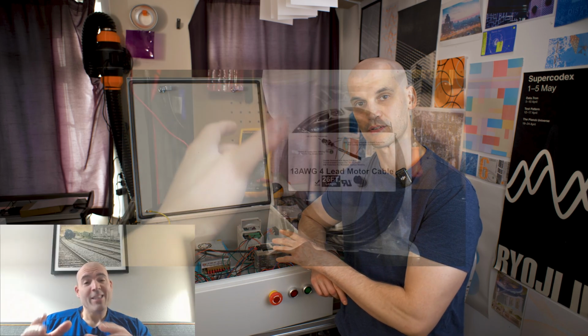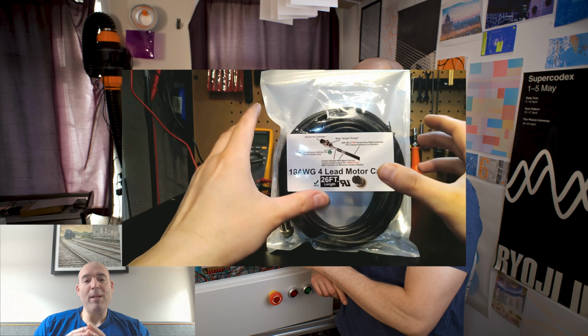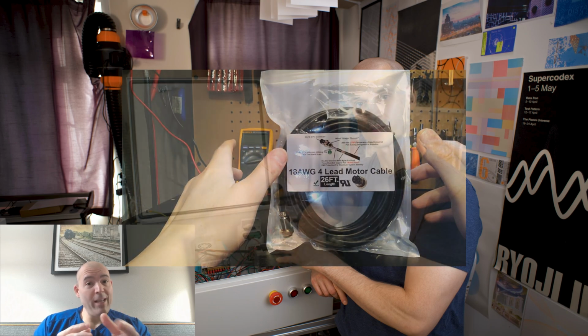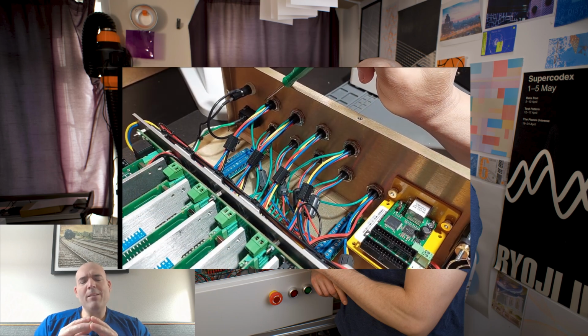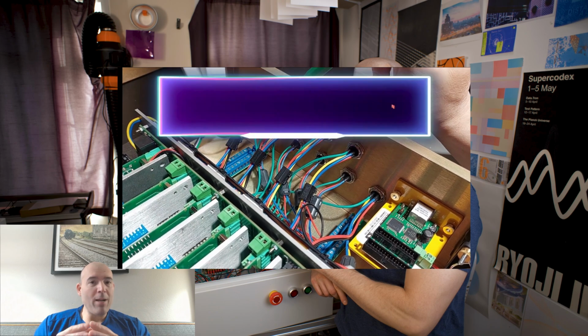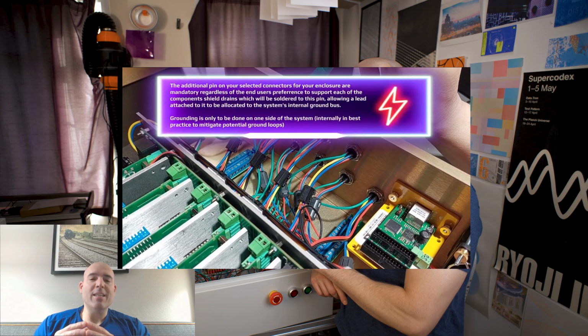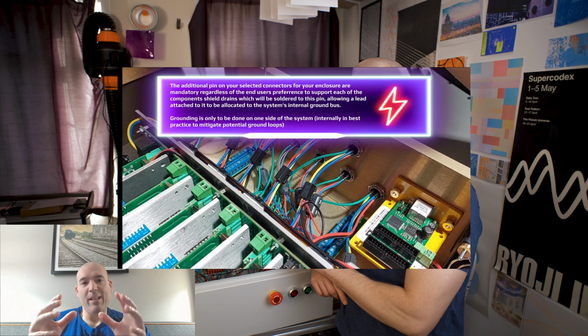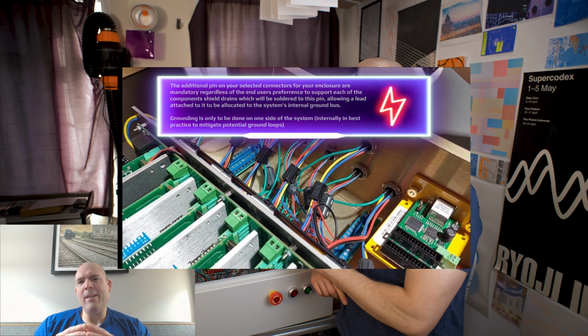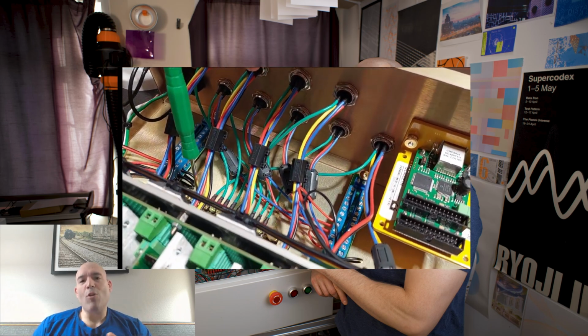Wow, Paul. Actually, I've covered these GX16 5-pin connectors used on my double shielded 18-gauge pre-built motor cables here. Or maybe you're talking about the time that I used them in my SMCU system, where it's an integrated drive system using 5-pin GX16 connectors, once again, with the 5th pin allocated to the shield drain, which I've covered in basically all of my videos. I don't know, the similarities are really getting crazy, and I think it's time that we expose some of how these similarities really pertain to my channel.